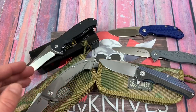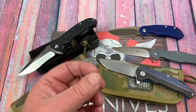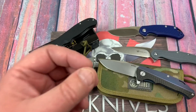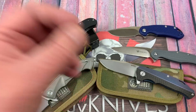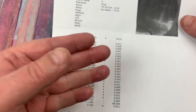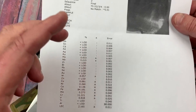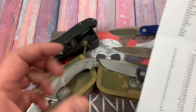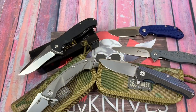They don't work with these other knife steels like S35VN, M390, and all that, but they do work with D2, with tool steel, so they do have that in their software suite and it does give you the actual reading. Otherwise these are just compared by the testing people with the elements of a known steel. So you get a Spyderco Sprint Run M390, you scan it, you scan the Tucson M390 knife, they match, then it's M390. So that's how that's done.